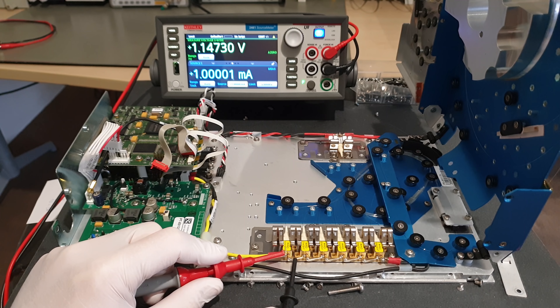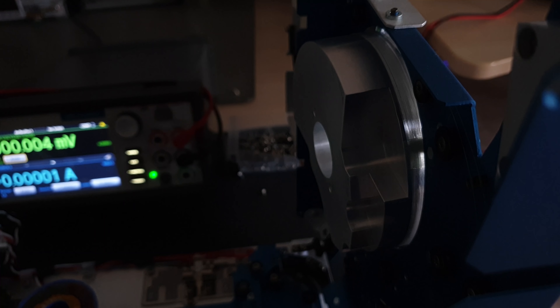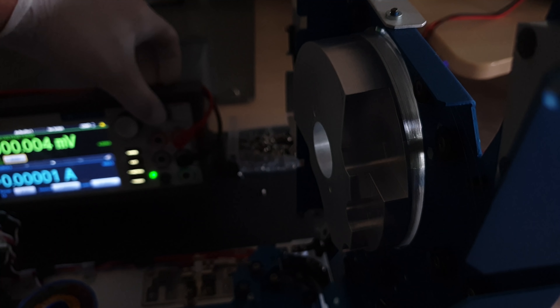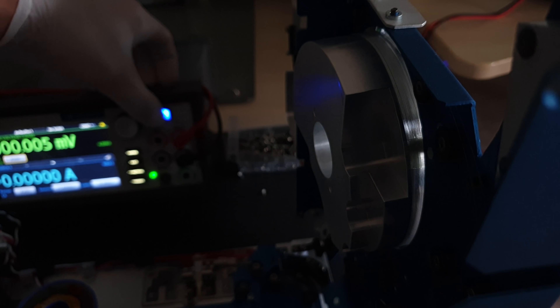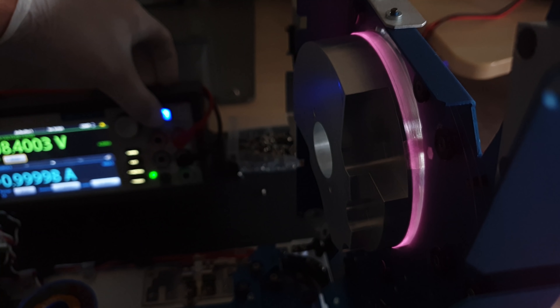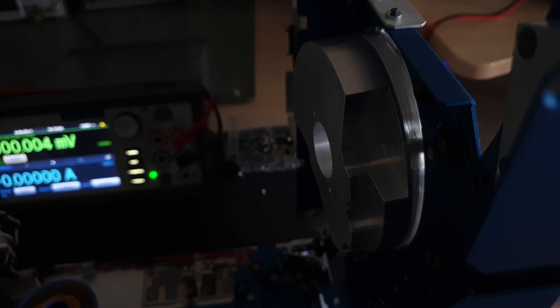Quick reminder: we still don't know why this thing was tossed in the first place. No obvious problems here though. As a matter of fact, we can even see that these guys are working properly — not with eyes, however, as this is all in infrared territory. The beautifully glowing fiber is one of those neatly wound active erbium-doped ones. We are using the laser diodes below to pump energy into it, but it can't take that much, so we are just causing heat and spontaneous emission in all directions — which we can see here. That's not very useful.